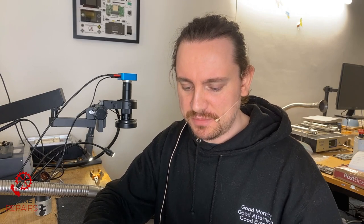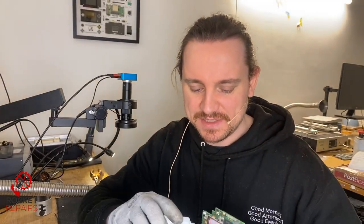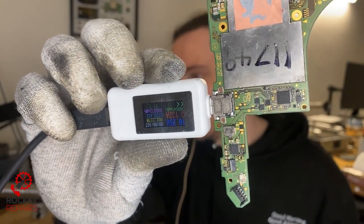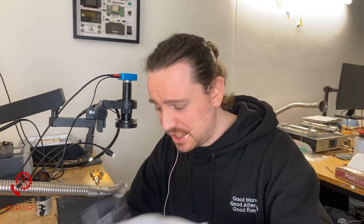Moment of truth — do we get anything on the Switch after a port swap and P13 as well? Do we get charging both ways? We get it one way — that's for sure, 130 milliamps. Let me turn it around just to make sure the port is good. Yes it works both ways — 135 milliamps, exactly the same issue. Just to confirm, in the housing with a battery connected we still have the 500 milliamp draw. I thought we were going to fix it, but such is repairs. Thank you for watching — if you have any idea what it might be, leave a comment down below so we can all learn together, and I'll see you in the next one. Peace.